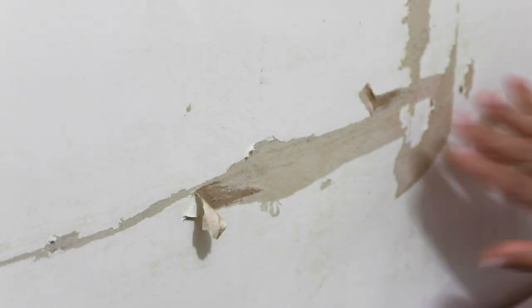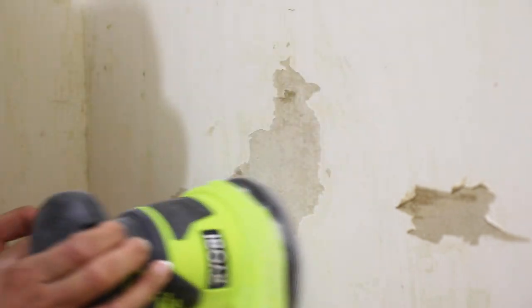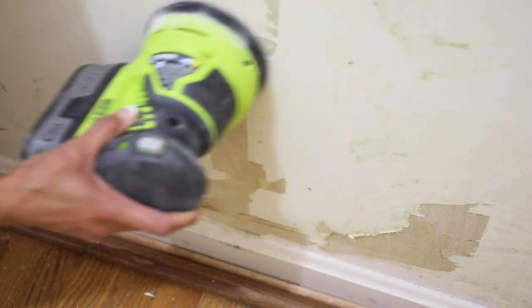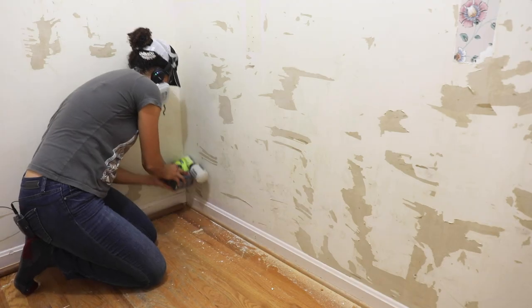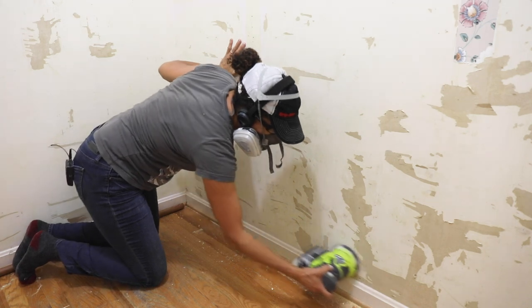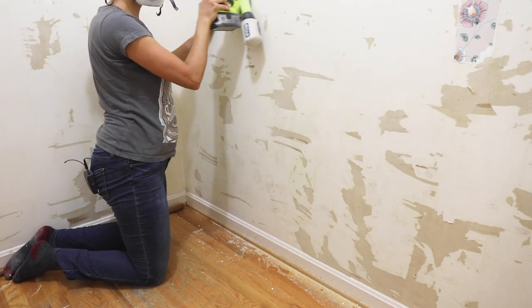Let's take a look at this paper bag area and have a listen. That crunchy sound — that's the sound you want to hear. That means your wall is dry. You should definitely wait 24 hours until your wall feels crunchy before you move on to this step. We are using 220 grit, very fine sandpaper. You'll want to do that over your entire wall. You'll see that crispiness where the wallpaper had pulled off the drywall — it's going to start falling off, crumbly. Run your hand over the wall while you're using this to check for any crunchiness or hard rough spots, because if you have that, it will show in your painting later.